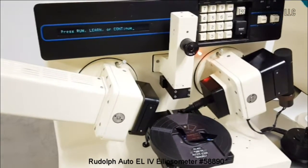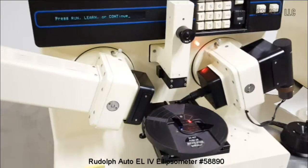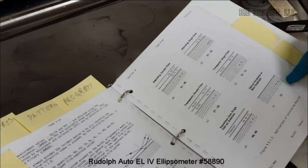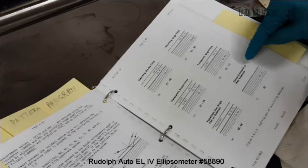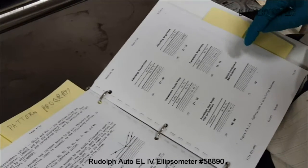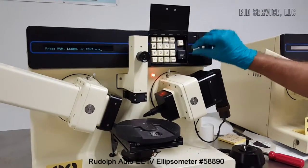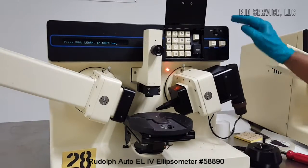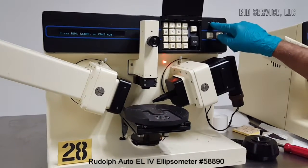The 'U' stands for upper layer. The system can be used for measuring multiple layers and also the optical constants of a bare substrate. In order to calculate the refractive index accurately for calibration purposes, a silicon dioxide film on a silicon substrate of about 1,100 angstroms thickness should be used. If any error messages appear, press the reset button to re-initialize the machine, or press escape to stop an operation. During normal operations, the ACT can be turned off once the sample alignment is completed for a batch of samples.